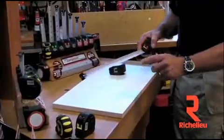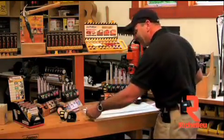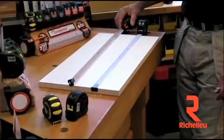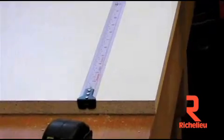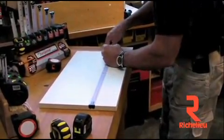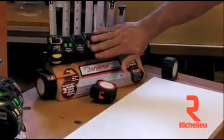And then of course we have our flat back tape measures, and these flat blades are really innovative as well. Typically a tape measure has standoff — the part that allows the tape measure to stand out — but these don't. These tape measures are really nice because when you lay them out on a panel like this, you can see the blade is totally flat. Where if you take a normal tape measure, you have to rock it from side to side to measure or to transfer the line — but not on the flat back tape measure. For layout, this is the ultimate tape measure. You put your marks on there and when you're done, you can retract the tape measure back in, and when you're ready to use it again, you lay it out and those marks are exactly where you want them for transferring and they are dead perfect. If you want to erase them, just simply rub on them like that. The gray cases are the flat backs, and all the other colors represent the other blade layouts.